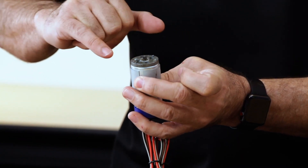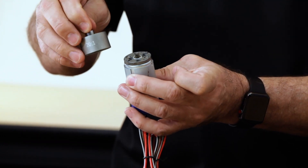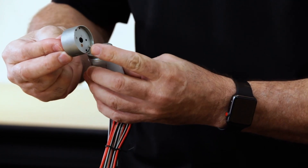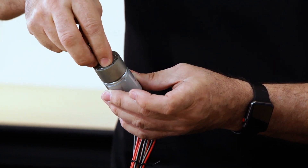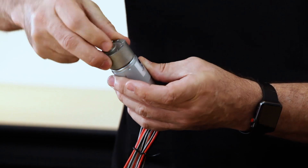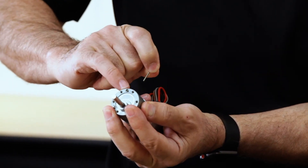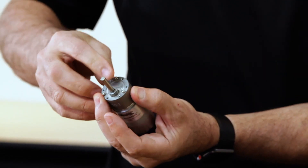The other thing is the screw pattern — there are three small mounting screws. I'm going to use the 20 to 1 so you can see how it works. The alignment pins match up to only two alignment holes in the gearbox. When you set it down and slowly rotate it just a little, you'll find a place where it just sets right down in — you'll know it's seated properly when that happens. The screw holes for the mounting screws have a slight indentation; they're not threaded all the way out — that's where you want to put the mounting screws.